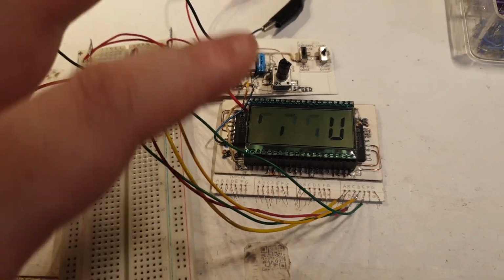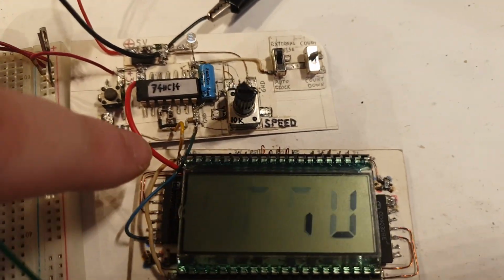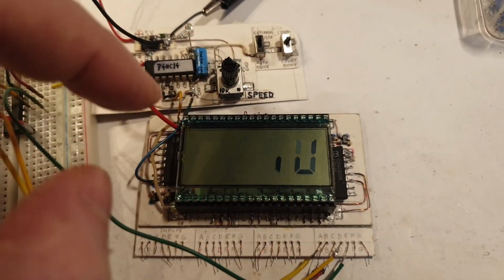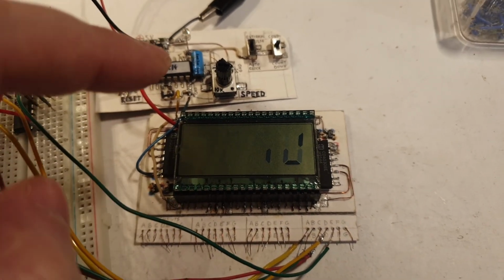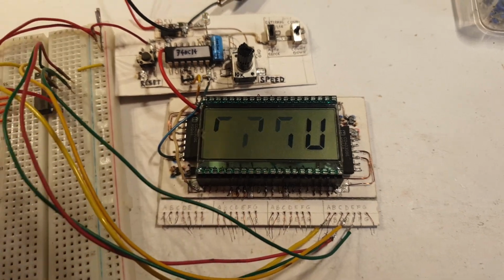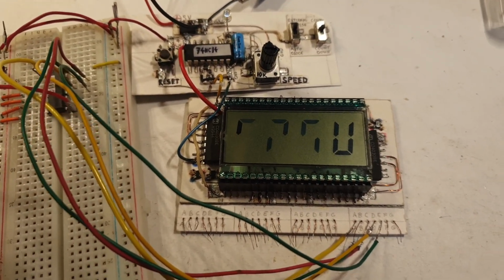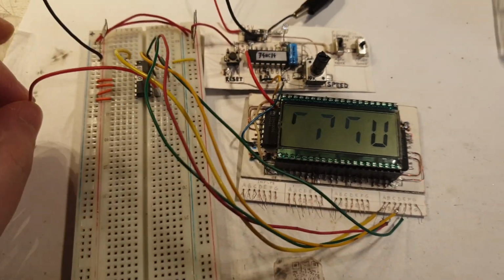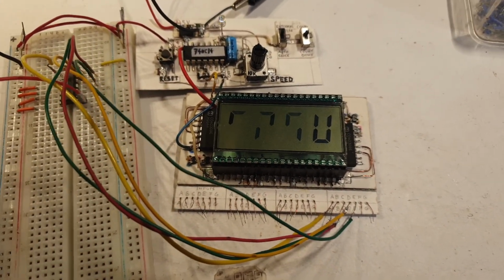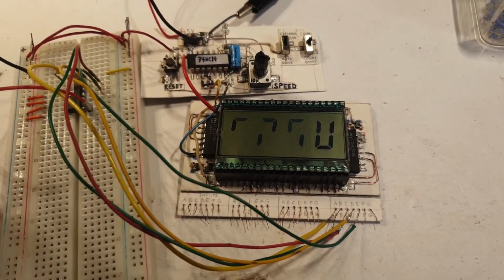Now at this stage of testing, I linked this pad with this pad, 40 with 1, because the LCD has the same 2 pads, probably for convenience. But I linked them together just to be sure it's not from the other pad that was left in the air, and it didn't solve anything. It wasn't that problem. And then I tried to do this. I really don't know how to solve this problem. It's very bad what I'm having here.